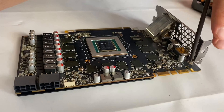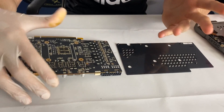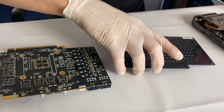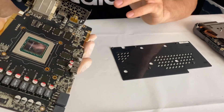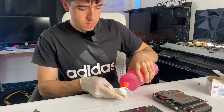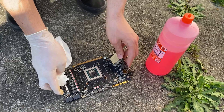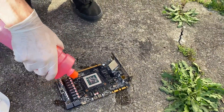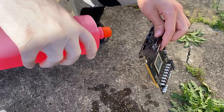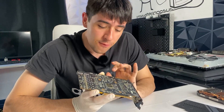The front isn't quite finished yet and we still have the back to do as well. The backplate on these Zotac cards from the GTX 1000 series is not an active cooler — it's just there for aesthetics — but we want to remove it because we're going to be doing a little bit of reflow and we want to clean it up properly. We also want to use isopropyl alcohol on the PCB because alcohol is hydro-repellent, so it will push out any remaining water. We apply it to the top of the card, the ports where water gets trapped, and the back.